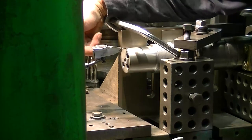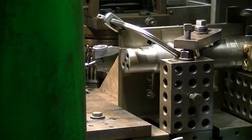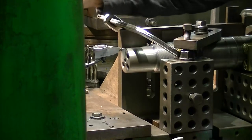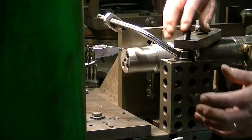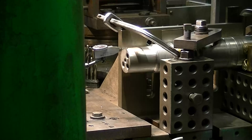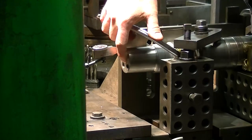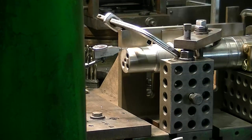So there's always some sag because of the flex in this and spring pressure. And it's basically something you figure out by turning the thing back around on your own spindle or using a similar rig on a bar and V-blocks, and you turn it upside down and just note how much it generally reads wrong. So anyway, I'm there. Now these holes are 7/16 from center line, or 7/8 inch apart. So we'll just move over 7/16 and up 7/16, and we'll drill our hole and tap.